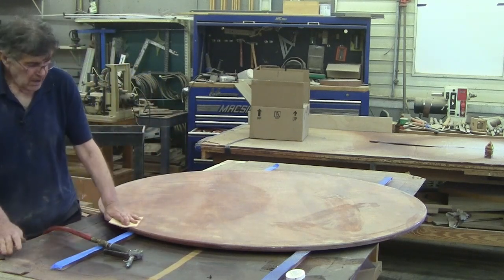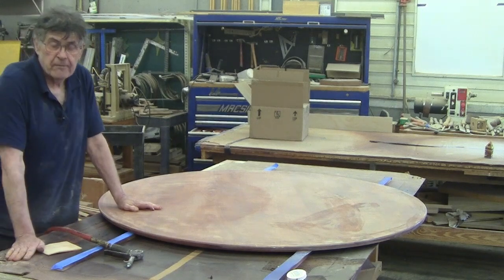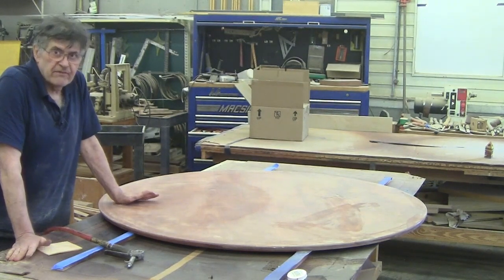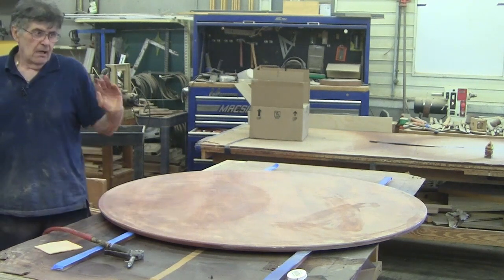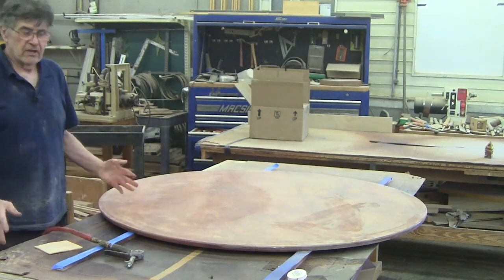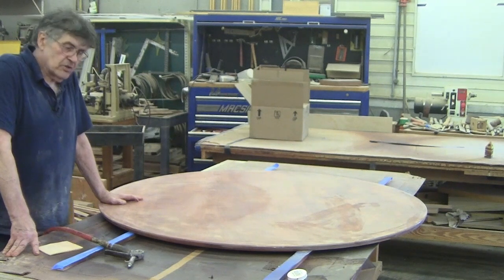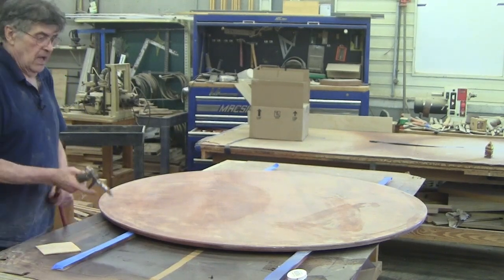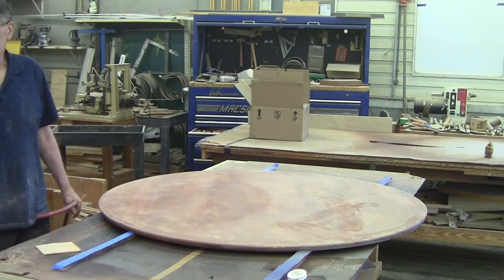Now that said, you'll notice that I've got 1, 2, 3, 4 tables, 5 tables in here set up to spray, or will be shortly. Common sense says I'm going to have a little bit of overspray, but it'll be the first coat of finish. When it gets to the final coat, I'll probably spray the big cherry table that you'll see in a minute, the one over here and the one in the back, because they're far enough. Now I'll probably take these over to the finished building, because this close of proximity, again, overspray. But I also know that I'm going to be scuffing them and shooting them a final time. Now the final shoot, I will add an extender in solvent. It's called retarder, to slow the dry.